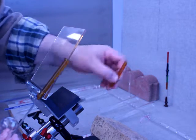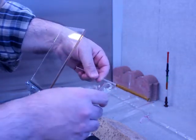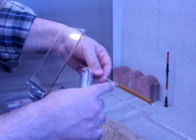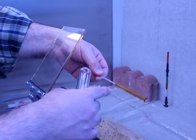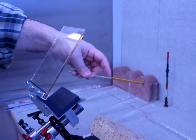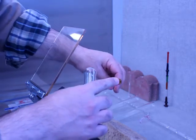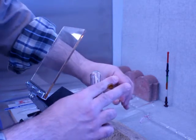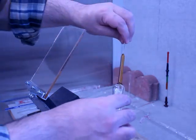Now, if you notice, this is the orange glass tubing. This is a piece, it's only been fire polished on one end. What I've done with this is I've sealed up one end, I've puntied it to 3mm glass. This is a weld. It's not a cold seal, it's a hot seal. And I've flared this that's going to go here. This flare is a little lopsided, that's going to hurt me, but that's fine.